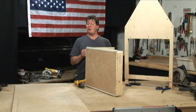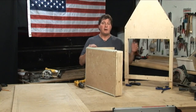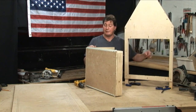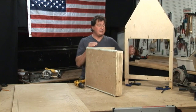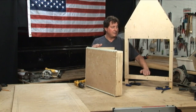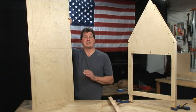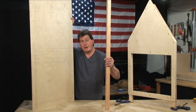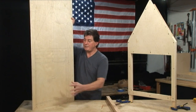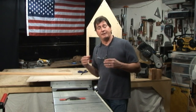Let's do some mathematics. With our bottom mount drawer glide hardware, the specs call for 7/16 of an inch between the drawer and the opening on both sides. So 7/16 times 2 equals 7/8, plus the drawer width of 17⅞ gives 18¾ inches wide. The height is 16 inches plus 7/8, giving 16⅞ inches. We'll lay out the side of our cat outhouse with those measurements. The overall width of our drawer wall is going to be 21⅞ inches.